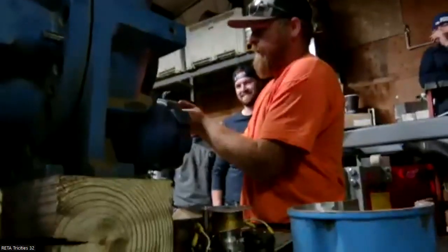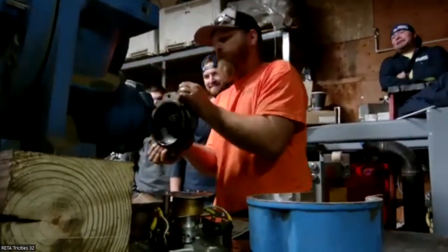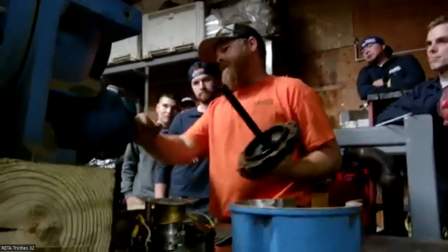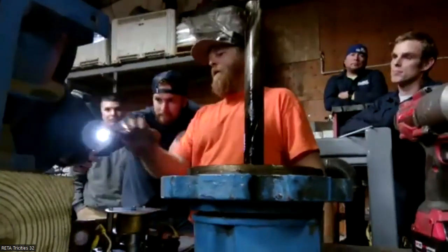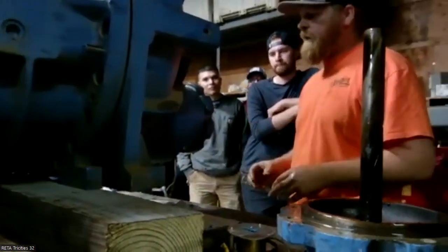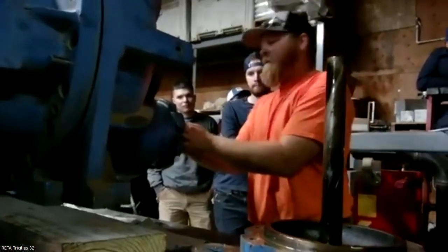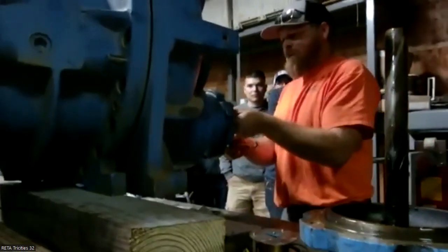And again, I removed O-rings off this for another assembly. So this is gonna be your spindle. This is gonna tell you where it's loaded at. There's a pin right here that drives it. If your machine's loading and unloading a lot, that pin gets worn and it will break. Then the machine will still load and unload, but your potentiometer is not gonna pick it up. With your unloader piston.